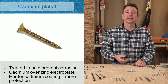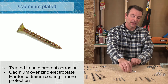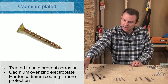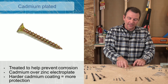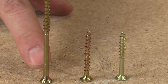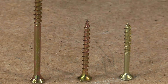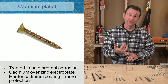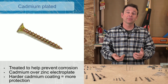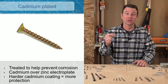If you want to bump that up a notch — say you want your zinc electroplate to last a little bit longer — you're going to cadmium plate over your zinc. The telltale signs for cadmium plating are a sort of a gold look to them, and some almost have a rainbow color effect — you might see some greens and pinks. Generally a gold look. So what you have is two layers: your steel fastener with a zinc electroplate, which is your silver, and then the gold on top is the cadmium. What the cadmium does is it hardens the zinc, which is a soft metal, and adds even more corrosion protection to your base zinc.